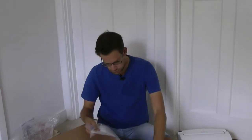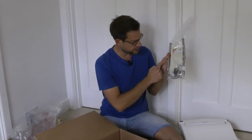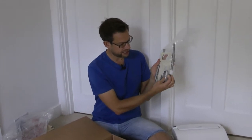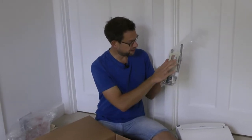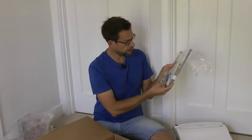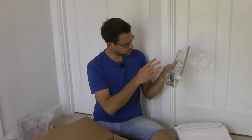There is an English user guide and installation manual, which is always good. And here's the plumbing kit. You've got a flexible steel braided hose which attaches to your existing loo inlet using a T-adapter. It looks like the mounting hardware fits into the existing holes in the ceramic of your loo for the seat to attach firmly. There's also a quick-release function so you can remove the whole seat to give it a really thorough clean.